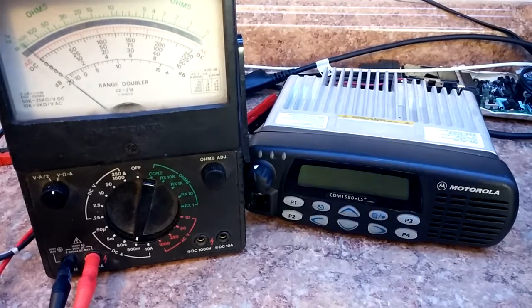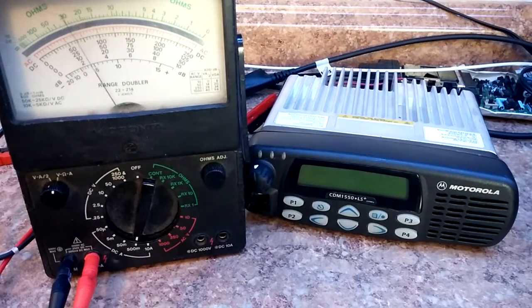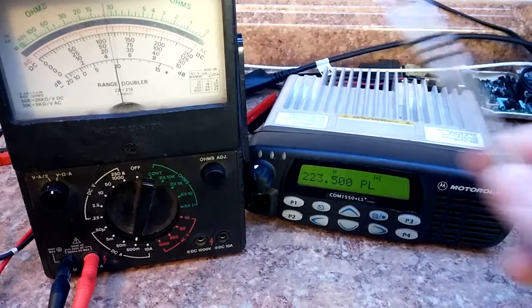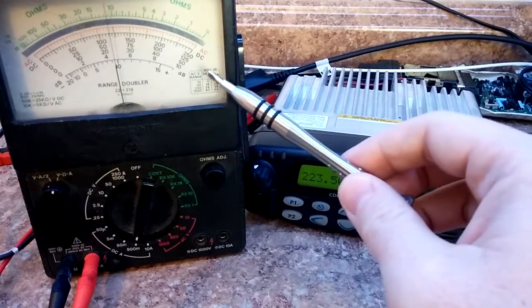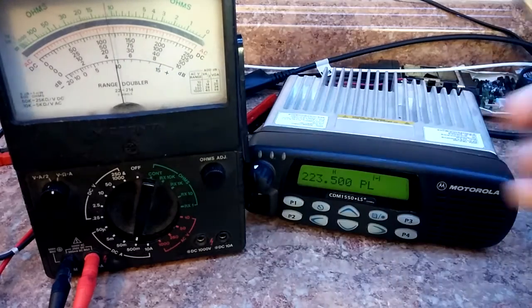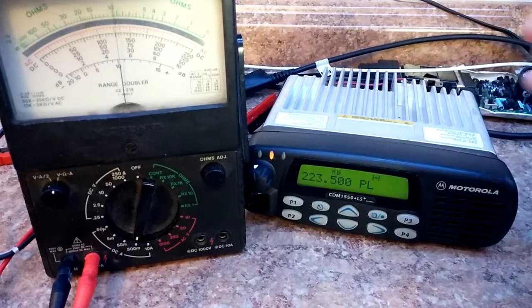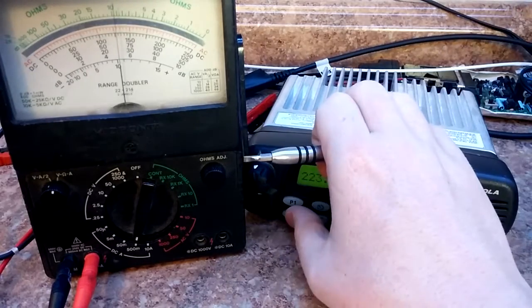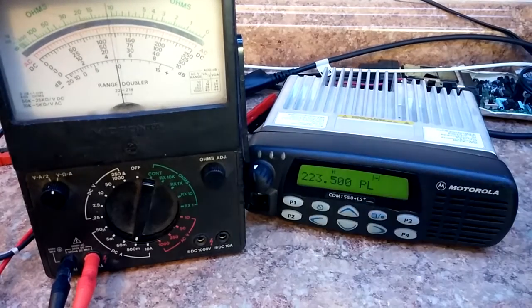You make certain the VCO locks and whatnot, you're fine. But this one here is actually a 220 one. I'll turn it on — I put a little current meter in line, because one of the other questions was how much current do these things draw. Right now we're on a 500 milliamp full-scale current meter, which puts us just around 200 milliamps, and if I unsquelch it — there we go — about half volume, just about 250 milliamps unsquelched.